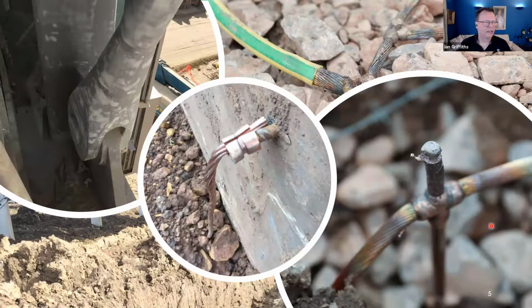So the coral, I think it's got properties similar to chalk. That's again another sedimentary. Typically, you're looking at around 350 ohm meters apparent resistivity in that kind of range, maybe a little bit higher, up to the 400, 500 range. So it's in the medium resistivity range, I'd say. So unless you can get under the coral layer, the enhancement materials might work well if they've got that doping, because the coral material itself is actually not that granular, or it shouldn't be.